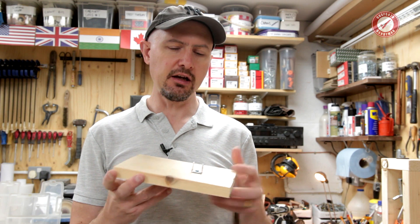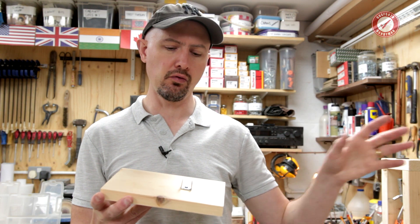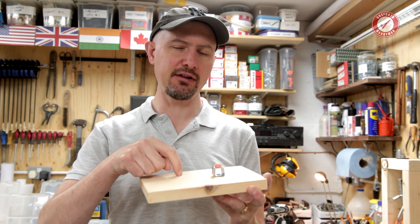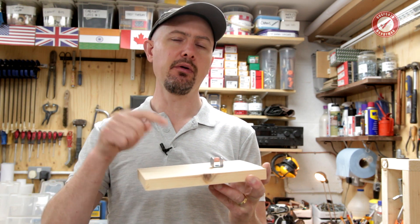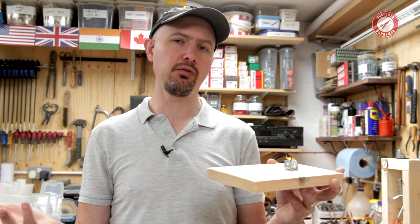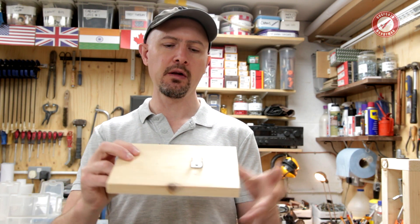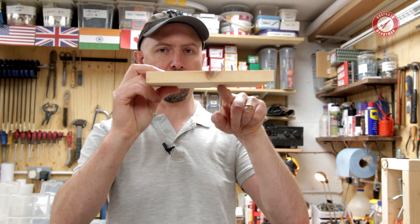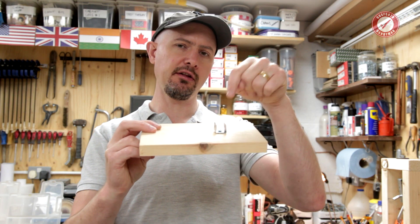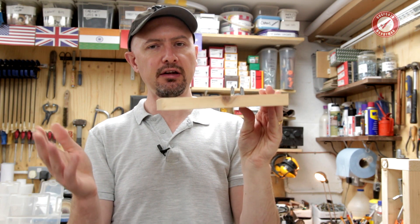In these tests today I'm doing them all with no pilot hole, because that's the way that we did the tests in the MDF and the oak. But in the next video I'm going to compare today's results to exactly the same tests but into piloted pine, so we'll do a direct comparison between no pilot hole and a pilot hole. But today: no pilot hole, full screw length. That means the screw is going to come out the other side of the wood — that's on purpose because we want to find out the strength of the wood across the full length of the thread. Same thickness of wood as all the other tests.